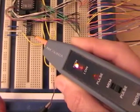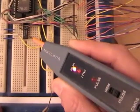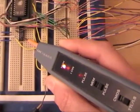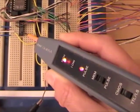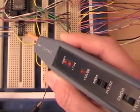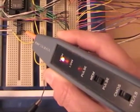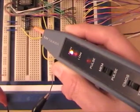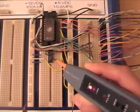Then it uses the other index register and counts down from 256, and every one of those activates this chip select — and now we're seeing that the pulsing is a little bit slower. And every 20 of those, using the accumulator to count down from 20, it'll work this chip select. There was one. There was another one. So that indicates to me that the CPU is operating and my circuit, EEPROM, and reset capability are all working.